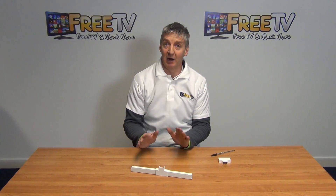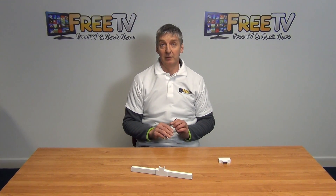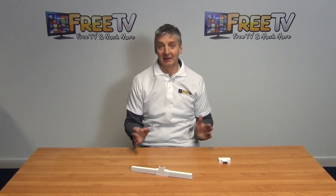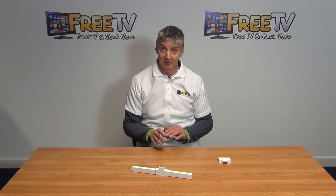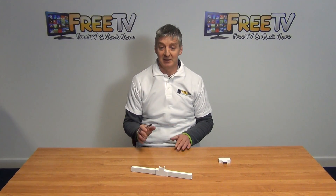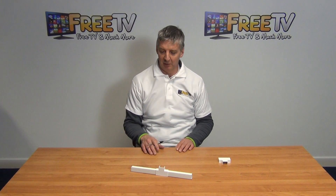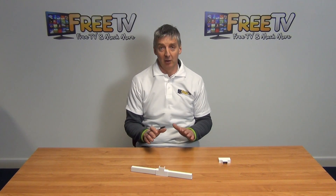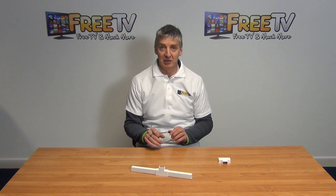Now this particular accessory is part of a wider range of accessories available for the 25 by 16 millimetre trunking — end caps, 90 degree bends, internal and external, and so on. The most common types of trunking used are the 16 by 16 and 25 by 16, which are very popular. All of this trunking and other electrical items are found in the electrical section of freetv.ie.